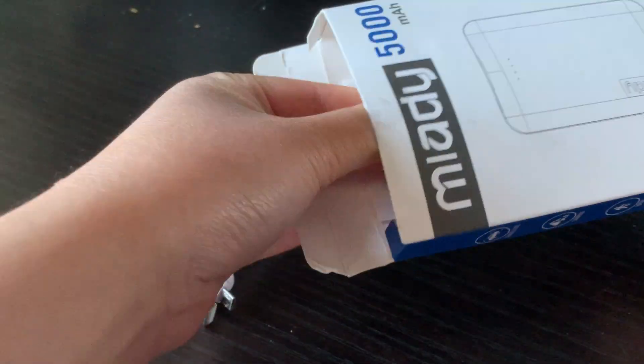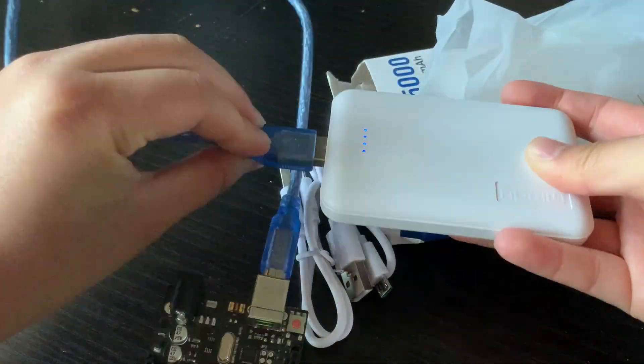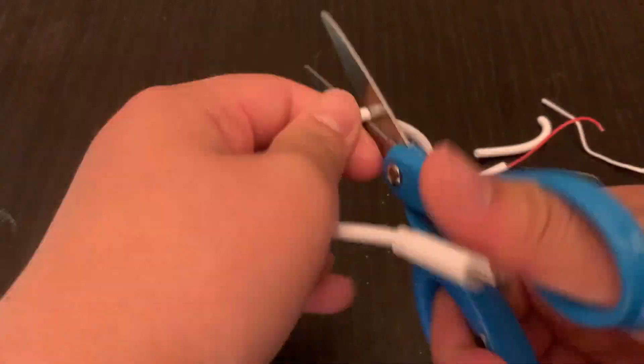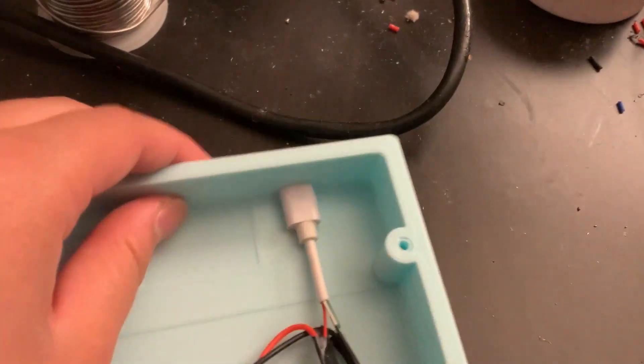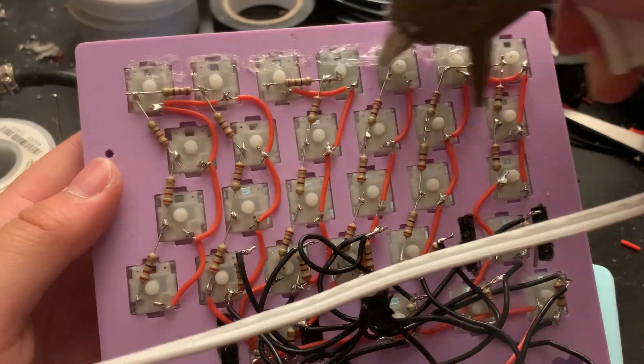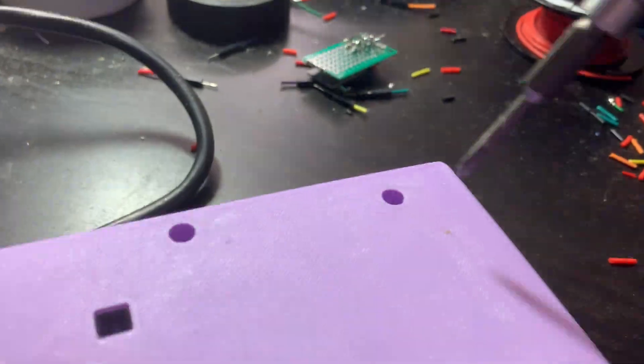For the batteries — as this was a wireless keyboard — I simply bought these compact portable phone chargers I found on Amazon. I had to cut up and reconnect some micro USB wires to create a port for it to recharge from. Finally, I added hot glue to the back of the key switches so that they would not come out, and screwed the case shut.